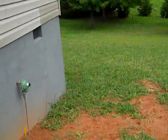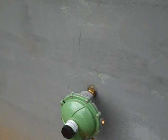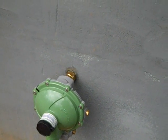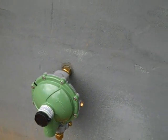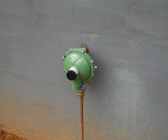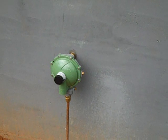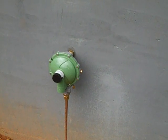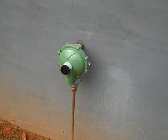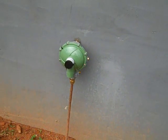We also teed off and ran poly line to the house. Before you get to the house you turn up — you can't come up with poly because it won't handle the sun for long — so you connect to copper and come up with another regulator set at 11 inches of water column, then branch off to the various appliances: water heaters, ranges, refrigerators, dryers, lighting, gas grills. Each appliance has its own regulator for further adjustment to ensure enough flow. Engineer 775 signing off from propane land.